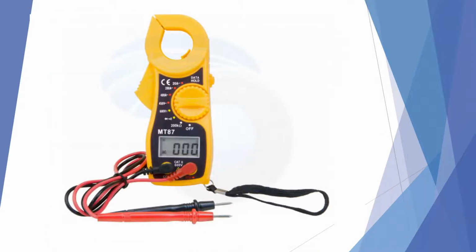We have stated before that there are meters that you can take amp draw readings on. This particular clamp-on also has probes that you can take voltage readings, but it has the clamp-on that you can put around a lead off a motor or a compressor and read the amp draw of that particular device. This is very important in proper troubleshooting and proper setup of an HVAC unit.